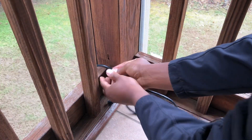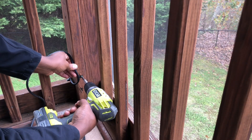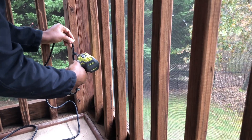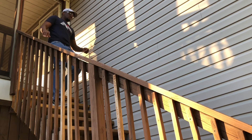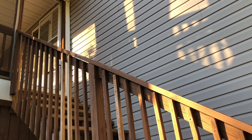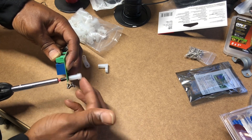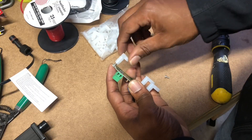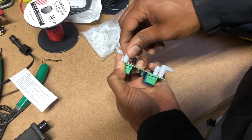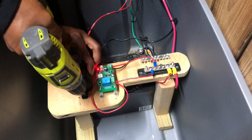Next, I picked back up on securing my extension cable to the inside wooden post. After I finished securing the extension cable, I switched my attention to the electrical side of the project since I wanted to verify I was receiving the correct voltage before connecting my LED string lights to the system. I started with the wifi relay that gave me the ability to remotely turn the string lights on and off. I attached plastic standoffs to the wifi relay to make the process of mounting it to my wooden stand and my electrical tote a lot easier. Before I could get started mounting the new wifi relay, I needed to move my heavy duty relay over to make some additional room.